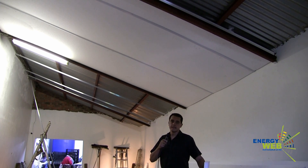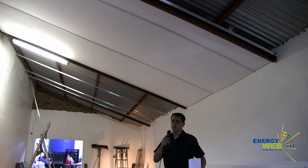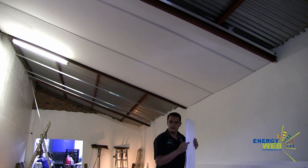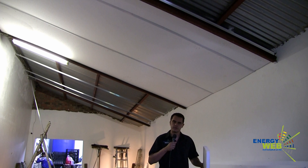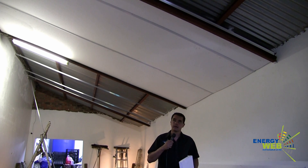As you can see, the boards are fitted now in half of the room. It went quite easy to install, and you can see it's a nice thick polystyrene that we've installed in the roof. The reason we go for the 40 millimeter is that it's quite rigid and it holds the shape of the ceiling very well.